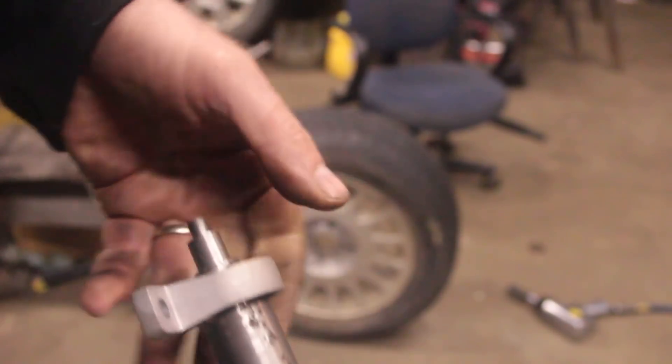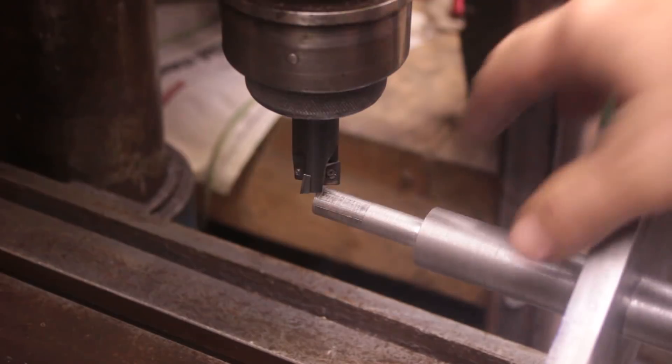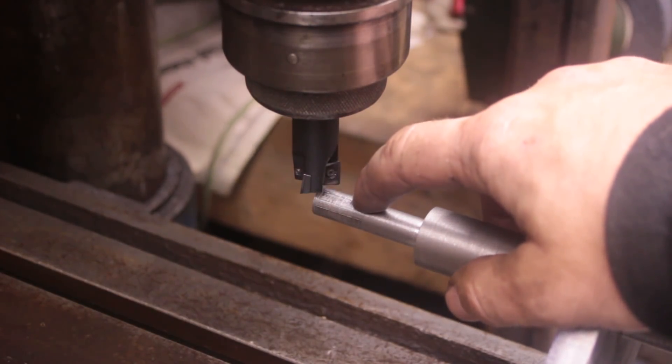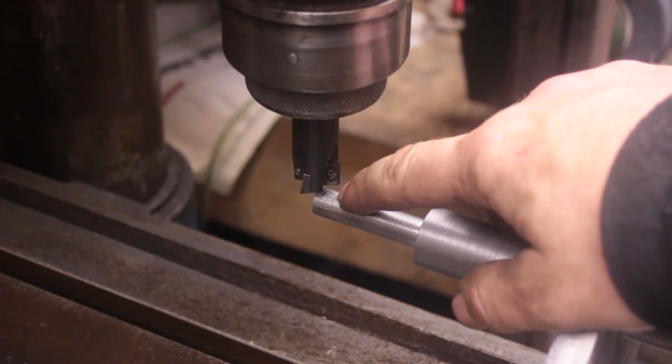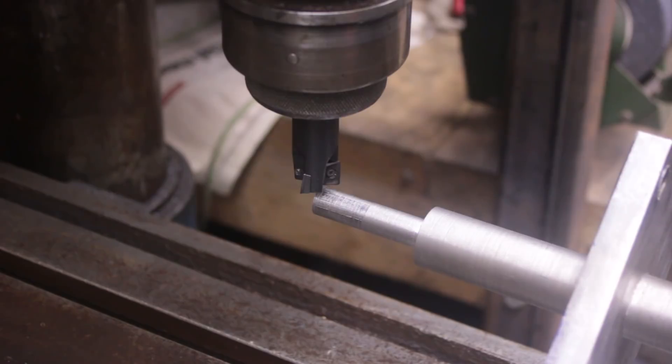The plan now is I'm going to machine a hex in on this side, so I can put a socket on it and then drive the socket with that ratchet attached to the drill. So it'll be a little bit cobbled together. This is my setup for milling the flats - I'm sure this is going to chatter like crazy, but thankfully surface finish means basically nothing on this. I just want a hex on here. This is 12 millimeter because we've got the bearings, so about half an inch, and I'm going to try cutting a 7/16ths hex. I'm expecting chatter and complaining, but hopefully nothing completely breaks.